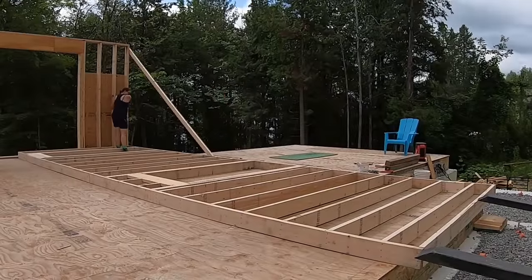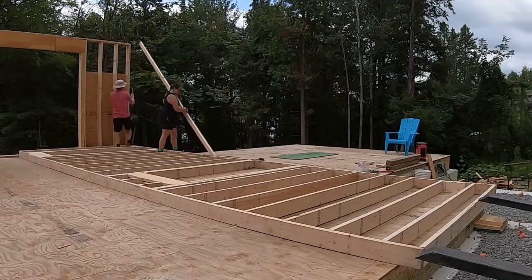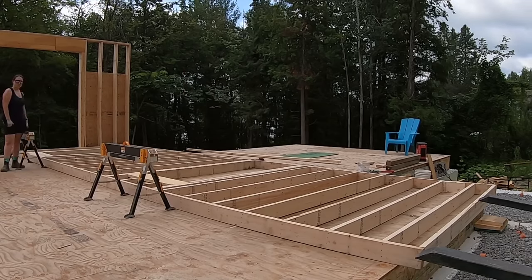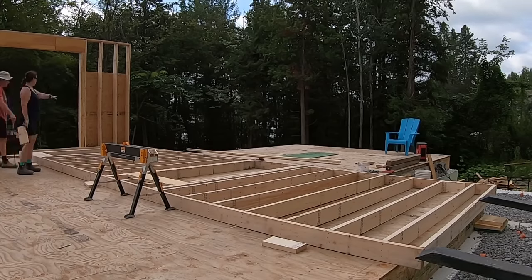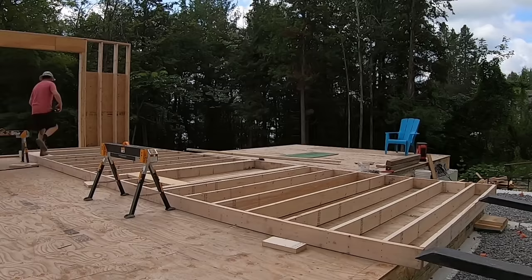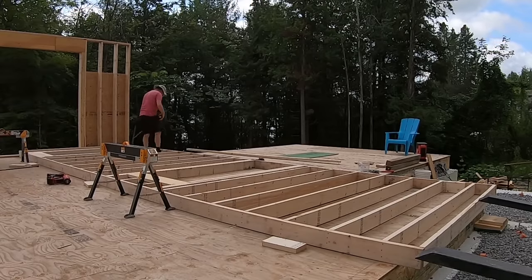We had to remove the one 2x4 brace holding up the wall, as the one we just built needs to stand up and then slide 5.5 inches to form the corner. I prepped to get ready to start lifting the wall and then realized that I didn't put the windowsill and cripples below it. I kind of jumped the gun and got excited to stand up the wall.